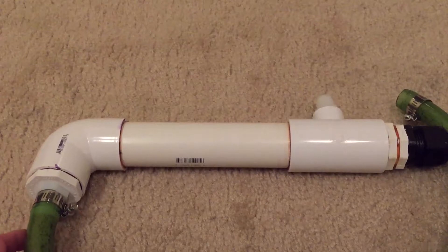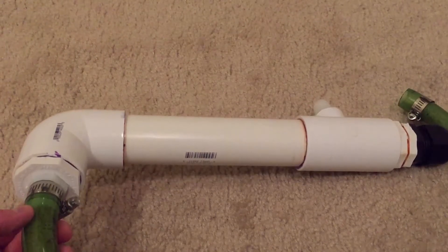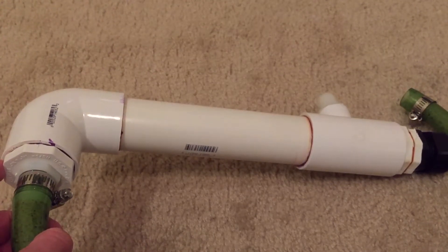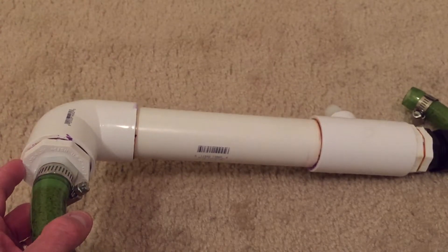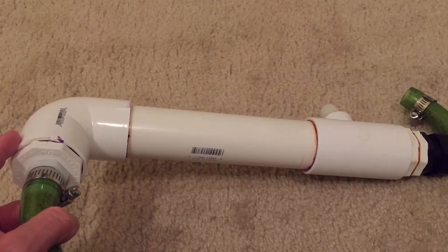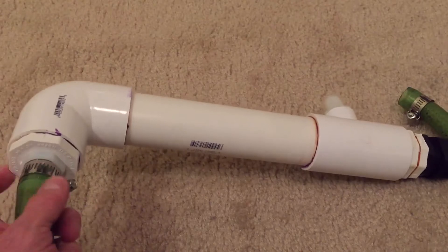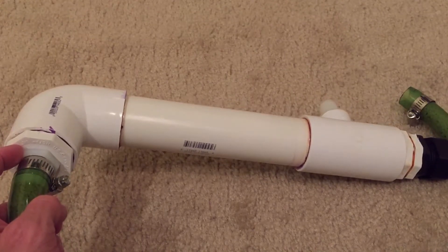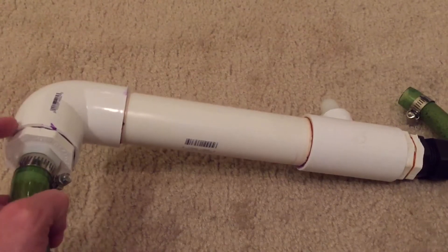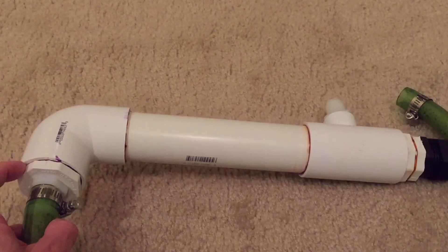It's going to depend on what your hardware store has, but for the most part you can usually do it with two fittings. There's a piece of PVC called a bushing that reduces from one-and-a-half inches down. The barb then screws into that with Teflon tape, and of course you're going to need some PVC cement — which is super easy if you don't know how; there are a million tutorials.